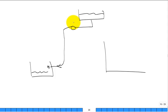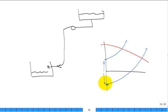It would work, true. And so what happens there is, let's say our pump curve is up here, but what does our system curve look like? Our system curve actually intersects at a negative A, so to speak, and it is quadratic up. See, instead of having this where it's positive, it's actually negative.